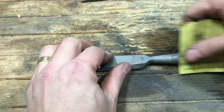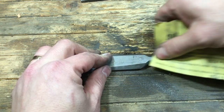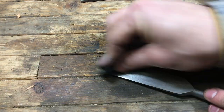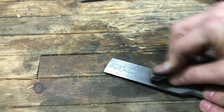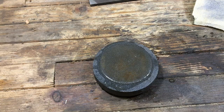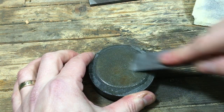I'm trying to keep it cool by sticking it in water so that I don't lose the tempering on the edge. Once that was done it was a matter of just cleaning it up a little bit. I really didn't want to take away the character this chisel had — I didn't want to polish it up to a mirror polish. I just wanted to clean it up enough so that it was nice and smooth, especially the bottom side so that it slid well.